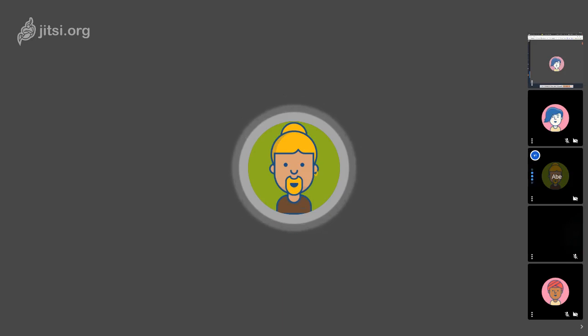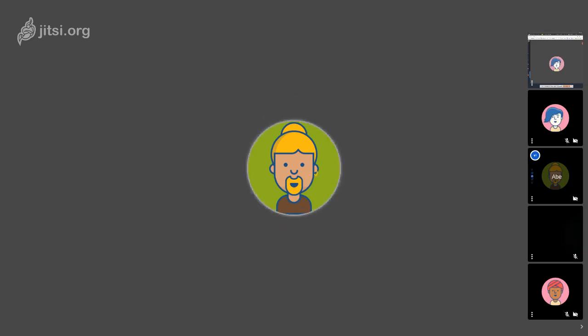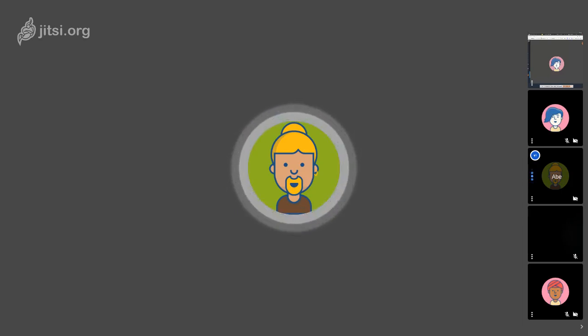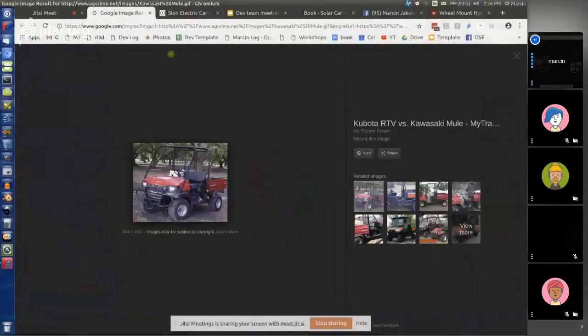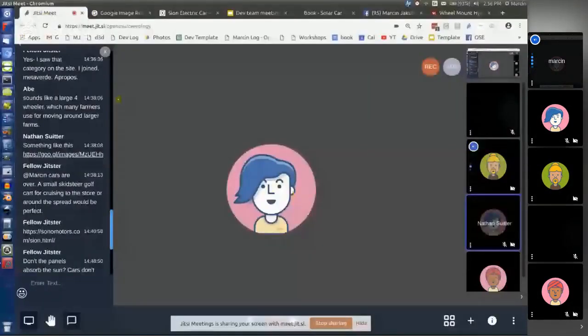And there are ways to do certain timing things without the delay, if necessary, in certain parts of the code, because the delay obviously holds up the processor. It stays within the delay function. It's kind of a loop. But I think the way that the machine works, the delays are okay because you don't need to do anything simultaneously. Delays are not a problem as long as the delay is under a second, because 100 milliseconds is perfectly fine.